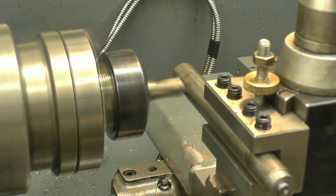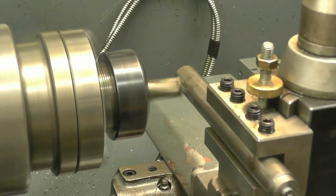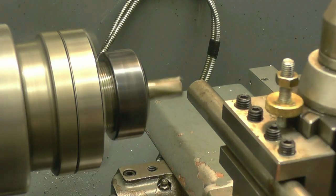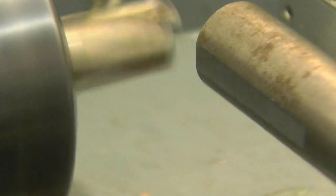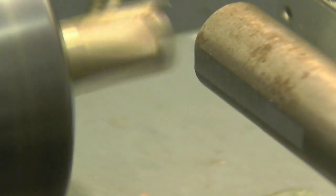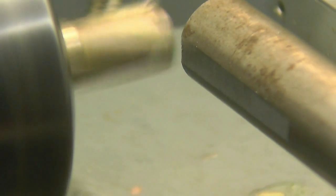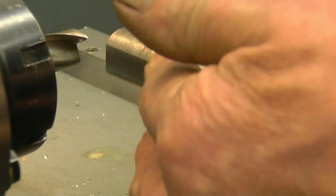You can put power feed on if you want to as well. You can see it cutting — the job is going in while cutting conventional milling, into the direction of rotation of the tool. I'll put on half a millimetre cut. That's a flat machined on there, no problem at all. I'll turn it around and we'll try to put the slot in.